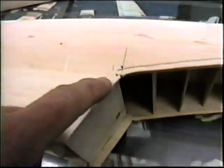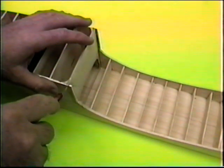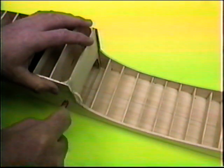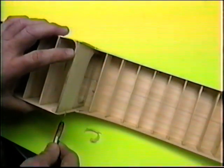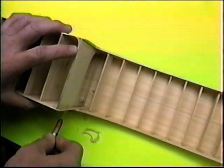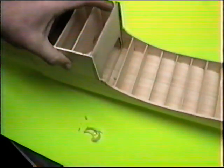But it's this center line here, and because it's a wood joint, we can never lose it, even if we go into silver and want to recover it for whatever reason. Now I can shave this down real gradually, and the last little bit I'll take out with the sandpaper. I want to go right up to our center line, but not past it. See, that's how much extra I had. I want to get that last little bit out.